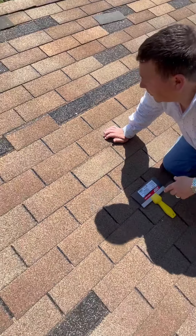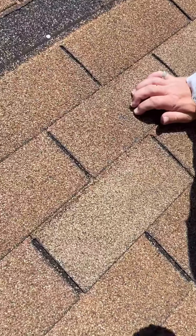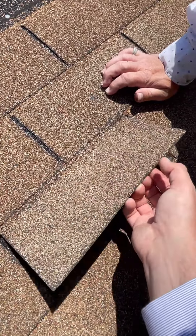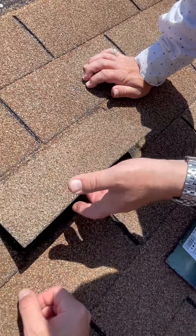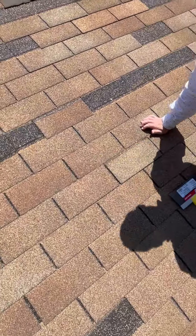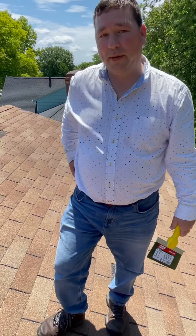So there's no possible way we would be able to repair this roof. The damage is spread over all — plus you got two layers on cedar besides. And these things are as brittle as they come. See how that one lifts up when you lift this one up. This shingle is definitely not repairable, and we would definitely recommend a full roof replacement. I've been doing this for 20 years. There's no way in good faith that we could repair these shingles — it'll be leaking inside of a month to six months for sure.